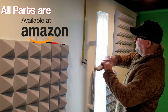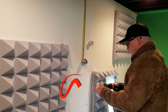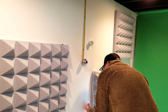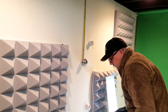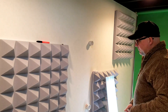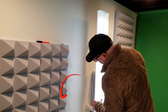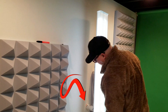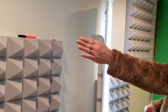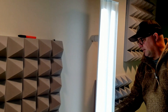Be sure to level it out — it's going to look nicer and function better. Make sure you hit the stud that is in line with that top cap. Place your bottom cap in place, and once that's screwed in you're ready to position your light. Do not glue these — they'll be tight enough where they won't fall off the wall and they're removable. You don't want to glue it because you'll never get it off the wall without breaking the fixture. Just push it in place; don't push too hard or you'll break the fixture. Get it tight, and now you can swivel it.